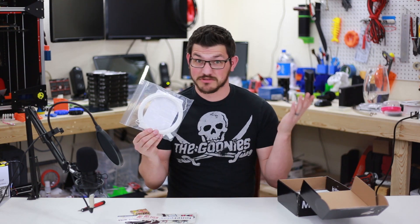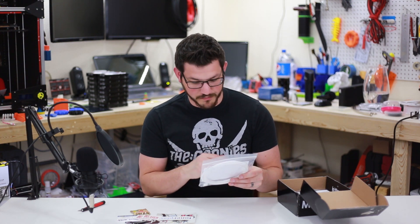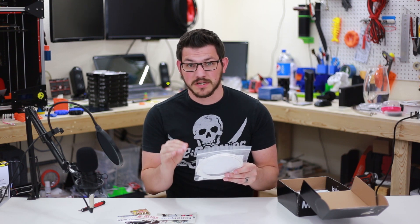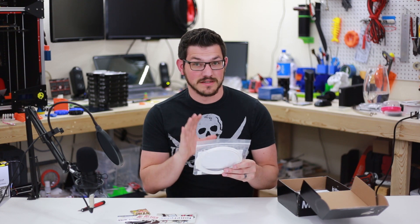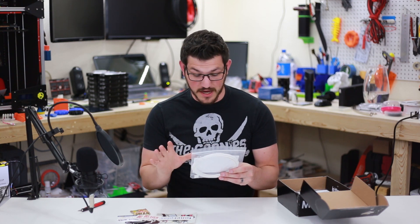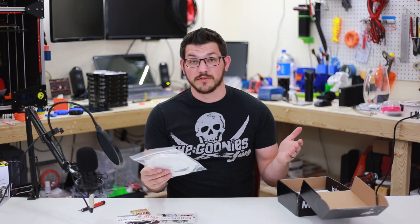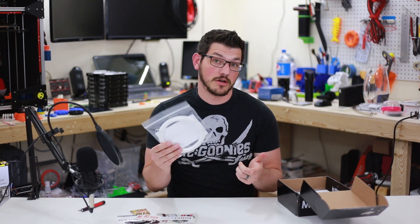We also have PLA from MakerBox - this is their own white PLA. Info: 'We are proud to announce our own line of PLA to get you quality PLA at a low cost.' I'm all about finding low cost PLA that prints the best. I have high hopes for this because the guys at MakerBox go through a lot of different filaments. Print settings: hot end temperature 190 to 220, bed temperature 0 to 60, speed 30 to 70 millimeters a second. And as usual, all of these have a coupon code so you can buy the filament off the makerbox.me website.